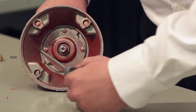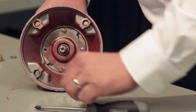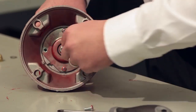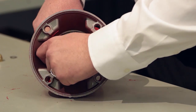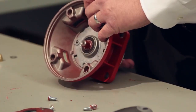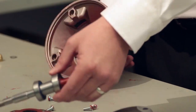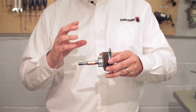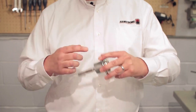I want to show you how easy it is to get this bearing module out of the bearing assembly — it's literally four Phillips-head screws. When you reassemble this, you may want to use some anti-seize to avoid damaging the assembly. After removing the last screw, take the backing plate off easily and push the assembly through by hand — you may have to tap it with a mallet, but it comes out very simply. Typically you'll be removing a sleeve-type bearing that requires lubrication, but you have the option to upgrade to the maintenance-free version, which has permanently lubricated ball bearings.